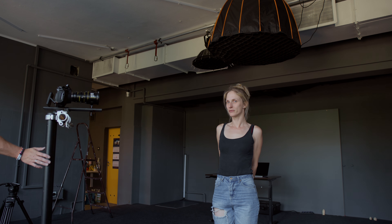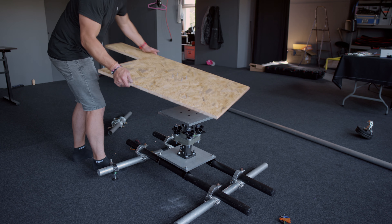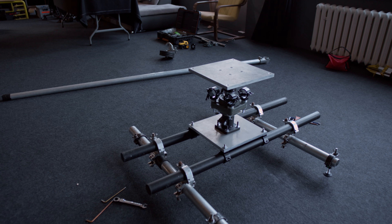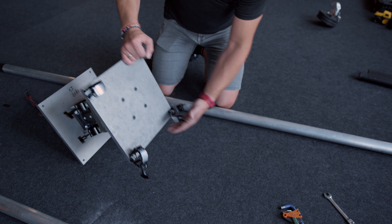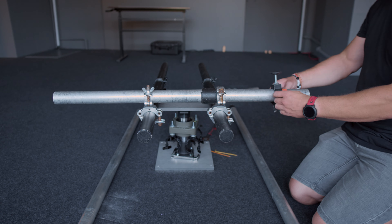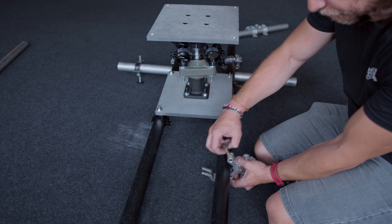Another improvement is a bigger base for more stability or a larger table when you want to place something huge inside. You can use any wood or metal plate and screw it to the original base. Another option is an adjustable aluminium stand also based on pipes, which makes the equipment easy to set up and portable. The adjustable design with clamps and tubes lets you completely customize the size; you can even make special adjustable legs to get a perfect level.